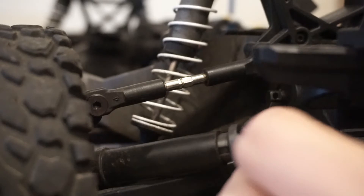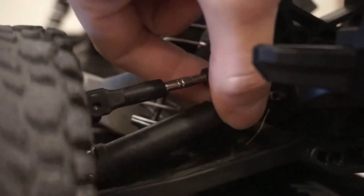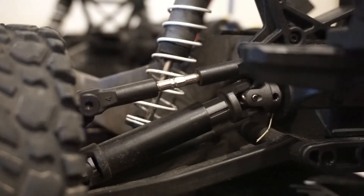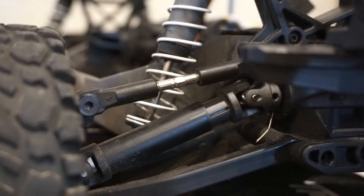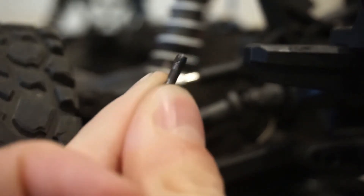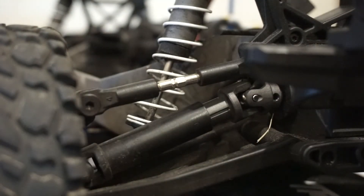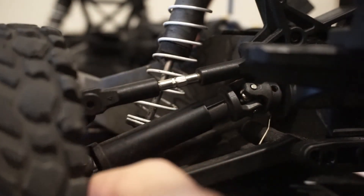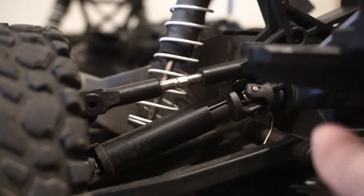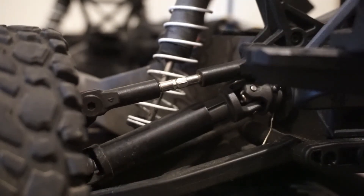This telescopes. Go ahead and insert this into this side, as long as this lines up with the little hole — just like that. It's gonna look like that. What I like to do is put a little bit of Thread Locker Blue Loctite on it so the grub screw doesn't come out. That's all we need is just a little bit of Thread Locker. Stick this back in there, make sure we're sticking it in the right way. Let's go ahead and screw this back in there.